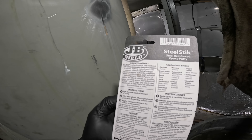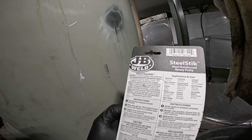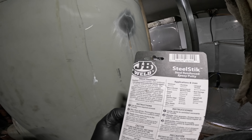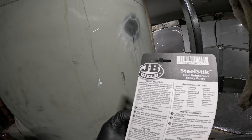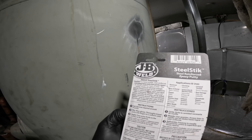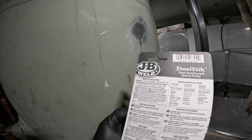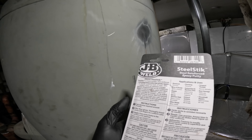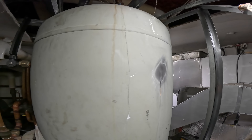Steel Stick is a hand-mixable, steel-reinforced, non-rusting epoxy putty that quickly repairs or rebuilds anything made of metal. After mixing, it forms an industrial-strength polymer compound that can be molded into shapes or used to build up, patch, and repair steel components. Steel Stick sets in three to five minutes, and after 60 minutes can be drilled, tapped, machined, ground, filed, and painted. It cures to a dark gray color, is rated at 4,000 PSI, and withstands temperatures up to 350 degrees — which is great since these boilers run at 140 to 150 degrees Fahrenheit.